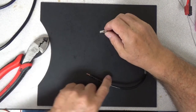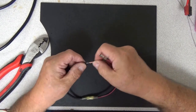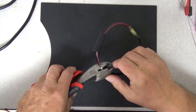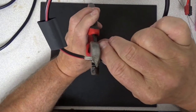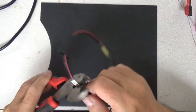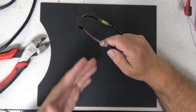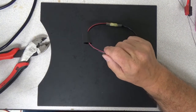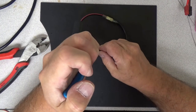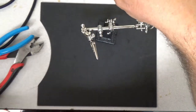I'm looking at how much wire I've got coming out — it's just about right. Now, if I don't feel like I'm really getting a strong crimp, it really doesn't matter. Why not? Because I'm going to be soldering this. I can also kind of bend it a little bit to get it sized down to the width. Let's go ahead and clamp this back in. Holding this myself and trying to do this is almost impossible. I actually want to look at the other side of this while I'm soldering it. I want a path for it to go in that way.